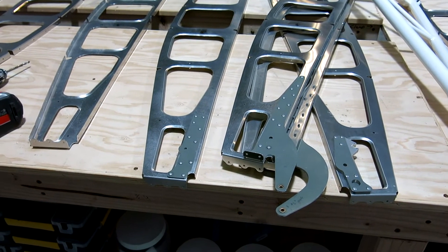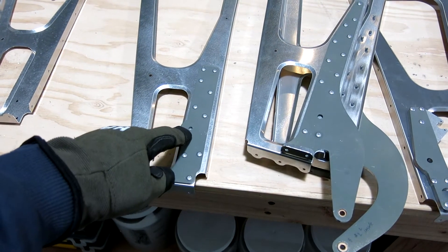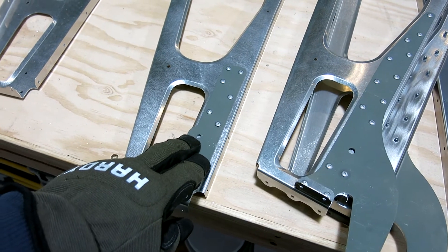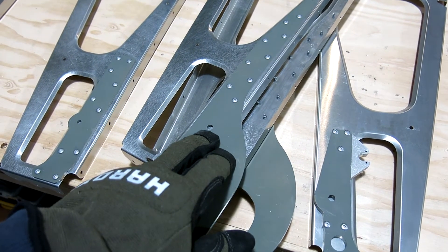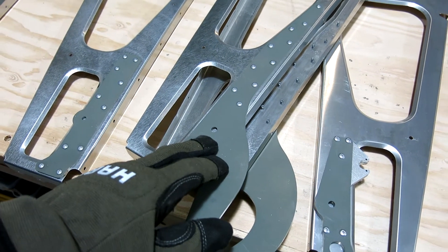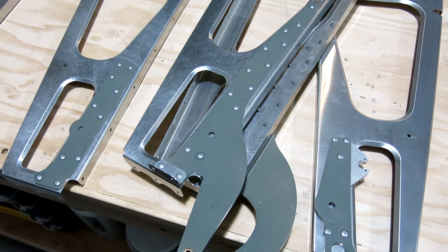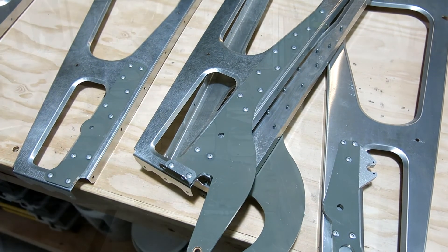December 6th, back at it. This afternoon we're starting off by upsizing this hole in this mount plate to a quarter inch. We're going to start by pilot drilling a 3/16 hole, then flip it over and put it on the drill press and final size it out to a quarter inch. We have to do the same thing on a couple others — some are already quarter inch, so I'll go 15/64s to give me a pilot hole through that rib, then drill press final size those. When we do the other wing, we'll do this before we rivet it on. I'm not sure why the instructions have you wait until after everything is riveted to do this, because now I'll probably have a couple chips down inside, but that's what the instructions say.